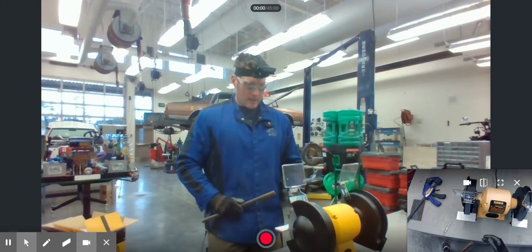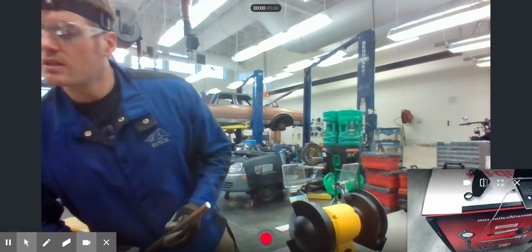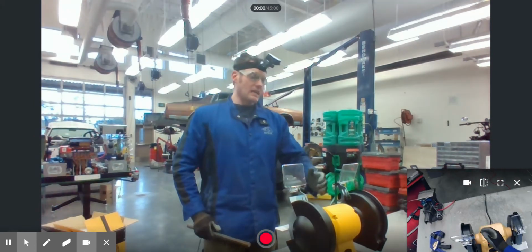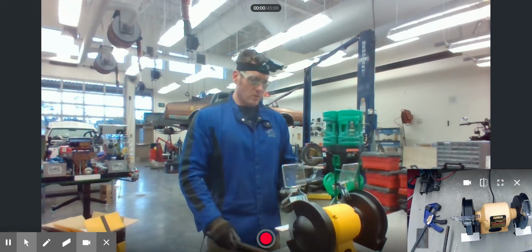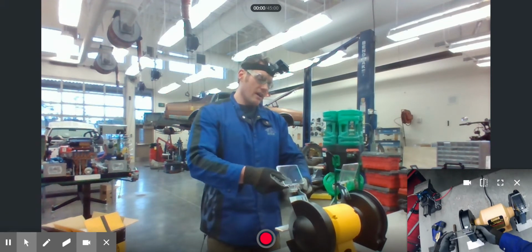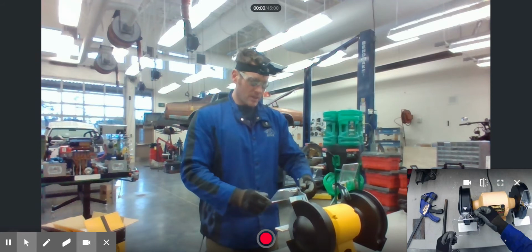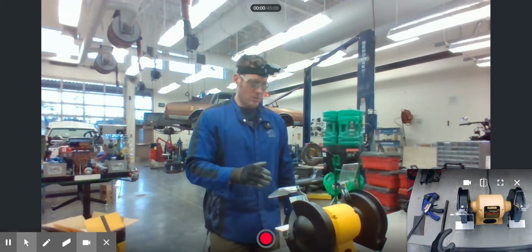All right, let's see. I think there was... Make sure there's no one behind the grinding wheel. Make sure they're not getting covered in sparks. Make sure that you do have your protective shield down. This will help protect your face from getting, obviously, any sparks in it.